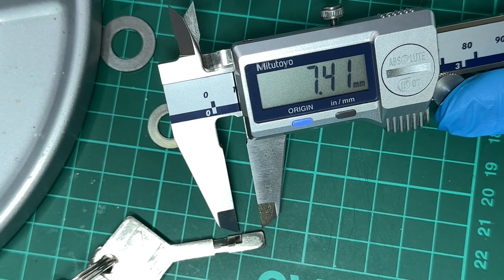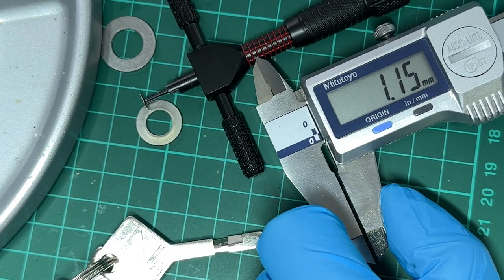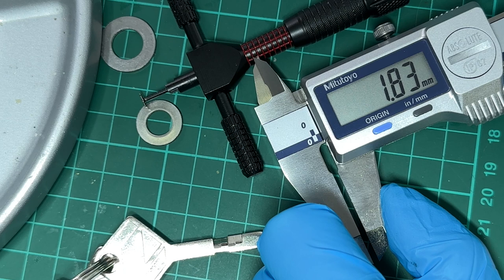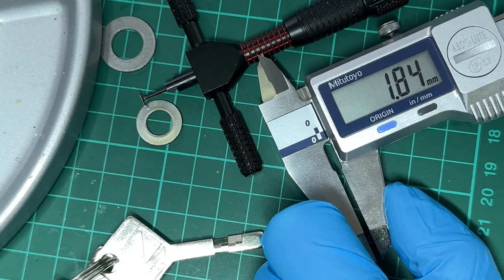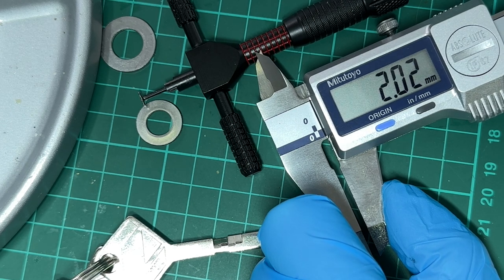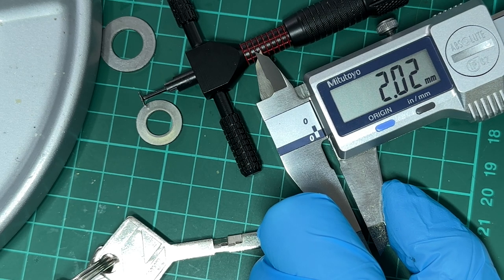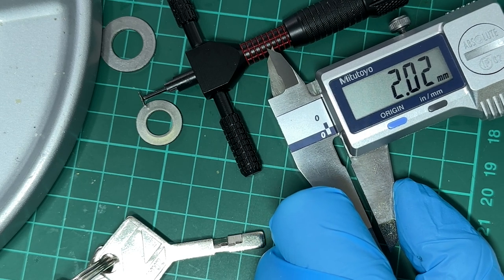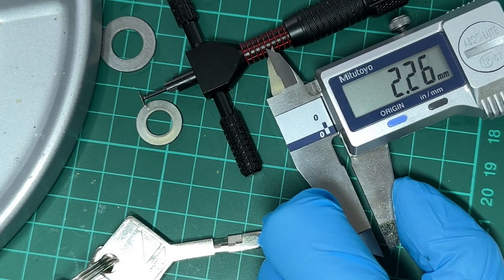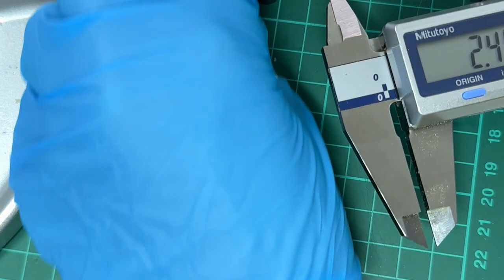So we look at the whole lock to get its measurement, and then we check out how deep our distances are here. Because we got one and a bit, so one unit is close to two. You're actually sticking those points into those curves, probably get closer to 2 millimeters now. And so that two out of the 7.41 that we saw will give us a sense of how many cuts worth of space the bottom of the lock is taking, and let us get to our 7 cuts.